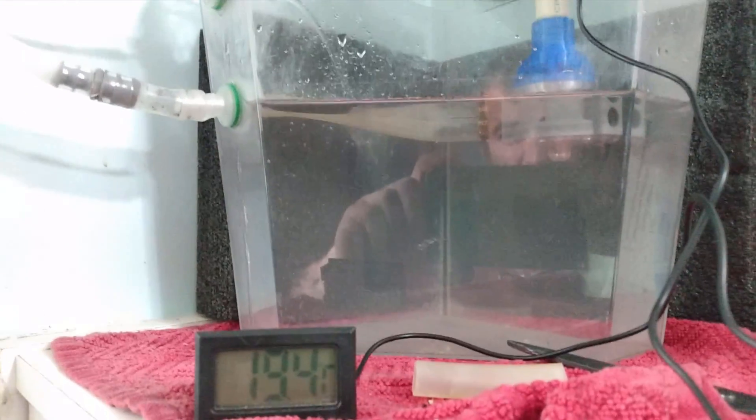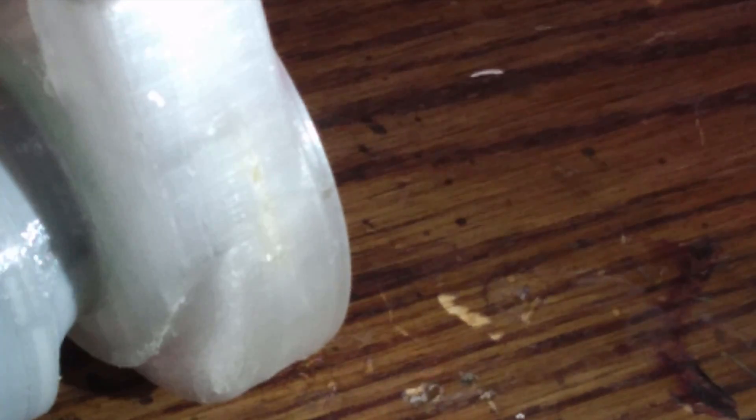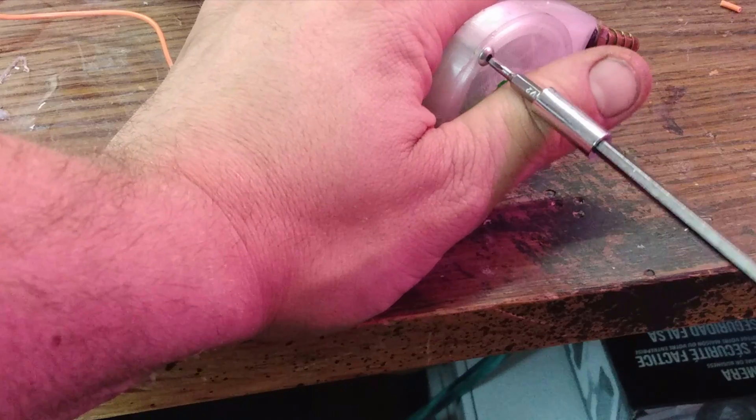With the sensor right in the return port, it's definitely a couple degrees colder than ambient — not as much as I was hoping, but it's not a very sunny day. I can clearly see where the centrifugal pump has cracked down the side up to the fitting. I'm assuming the tapered pipe fitting put a little too much pressure on it — with the temperature change and some vibration it couldn't hold up. This should easily be fixed with minor modifications or reprinting, probably just gluing it up and sanding the impeller where it's rubbing.